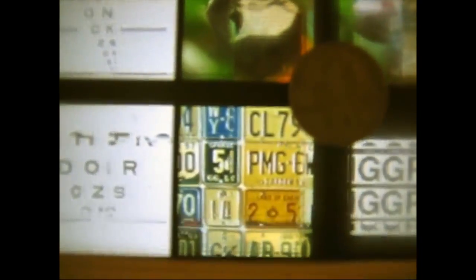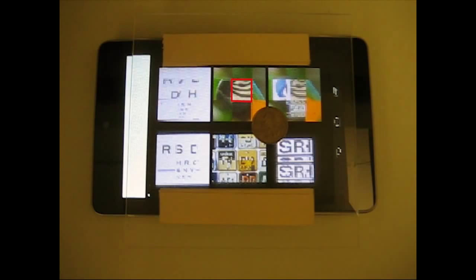Once within the minimum viewing distance, a single virtual image appears. Note that the lenses are imperceptible since the array is defocused. The red square denotes the previously mentioned viewing eye box. The microlens array requires manual alignment — rotation and translation must be altered in the depicted manner until the array is properly aligned with the film.